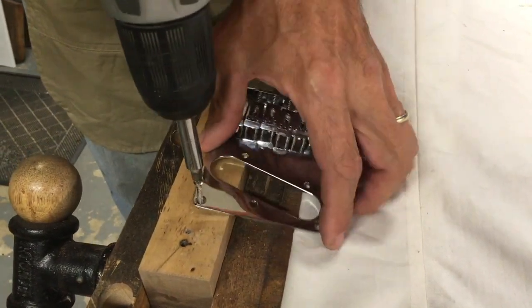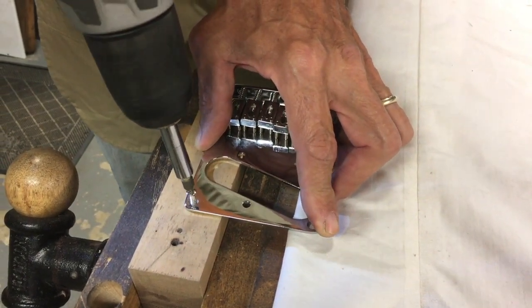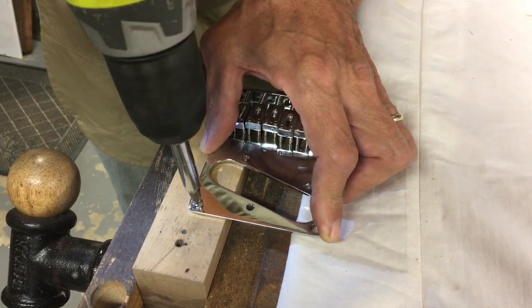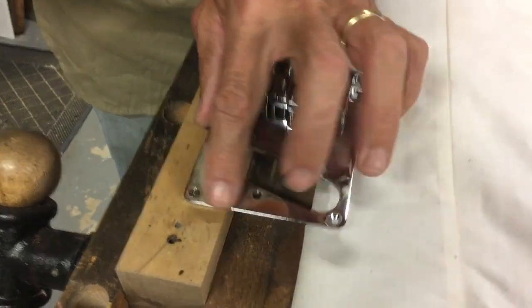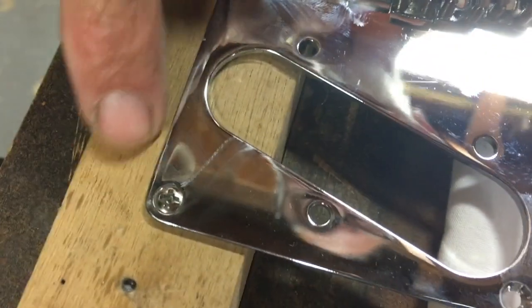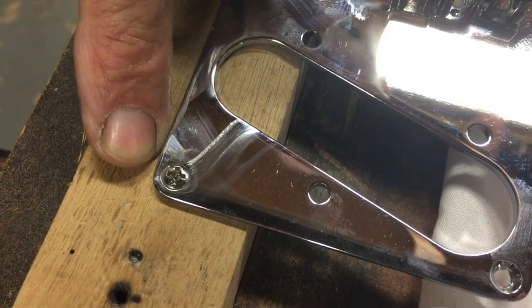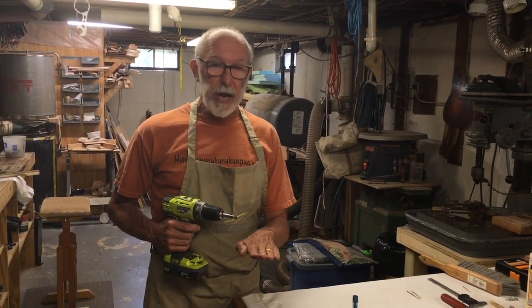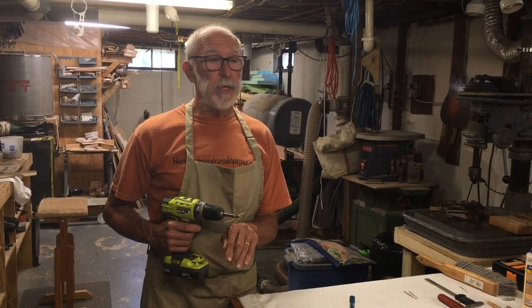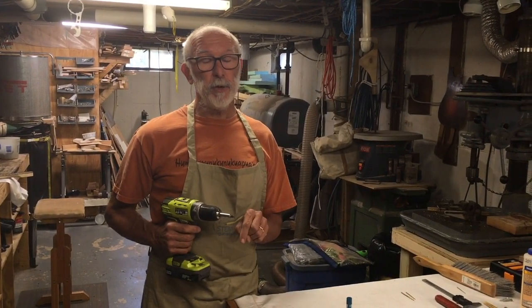So this is not going to be straight — let's see how well it sits even though it's at an angle. Even though that screw is coming in at an angle, it ends up finishing flush and no one would ever know there's a broken screw underneath it. That one was at a shallow enough angle that the screw head came down, sat into its bevel nicely, and looks decent. You're not always going to get that lucky — sometimes it's too much of an angle, it's too obvious, it just doesn't work, and then it's a little bit more difficult. That's what we're going to do next.